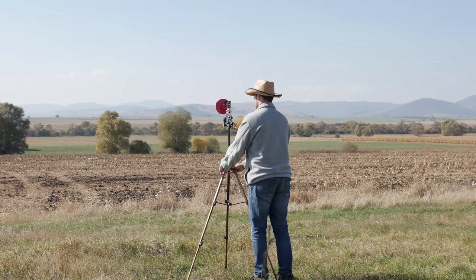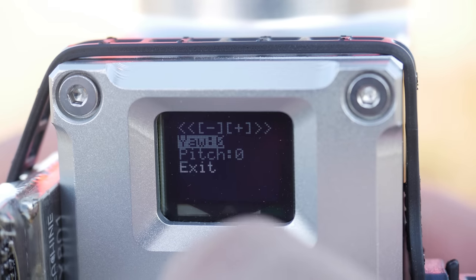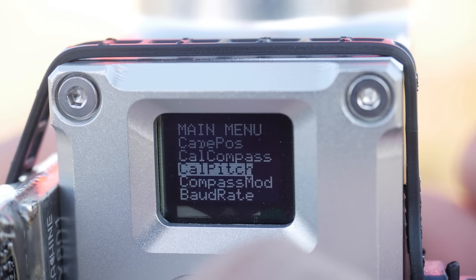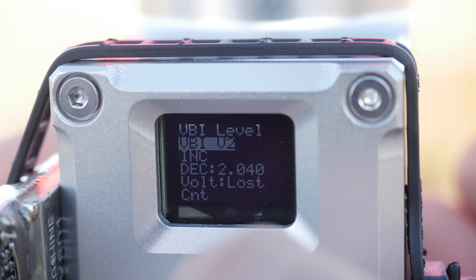When the timer is done, calibration is also done. Next, check which version of tracking data the tracker is set to. Go down the list until you reach VBI settings, press the left button to access it, and the very first line where it says VBI will need to match your module in the plane. If you have the old MyFlyDream Autopilot or the Telefly Pro OSD board in the model, set this to V1. If you have the Crosshair Autopilot or the Telefly Tiny board in the model, set this to V2. Both the Telefly Tiny and the Crosshair Autopilot also have a V1 option on them in case you will be using them with the old tracker.